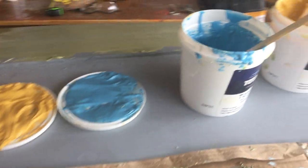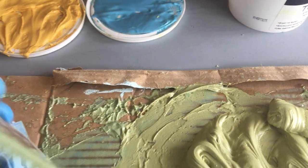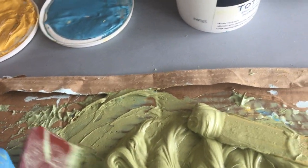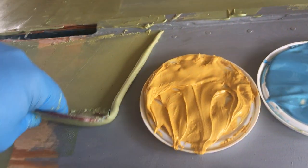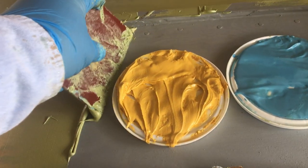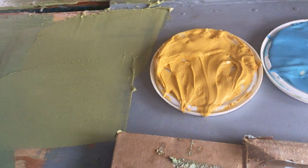We'll scoop up a little bit and then go along and find some of the holes. Try to go sideways — cross grain is what I'll do — then go along with light pressure and feather it out, just keep working on up to the bow.